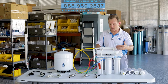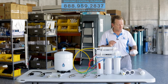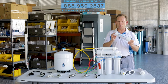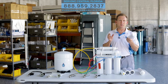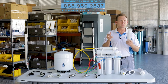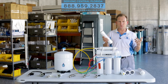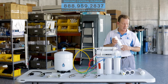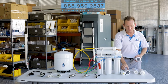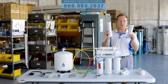In the S5 or S6 systems, you have three pre-filters. The first stage is a 5 micron. This will take out sediment, larger particles — and as we had mentioned in the other video, you're looking at 5 micron for filtration. You take a human hair, it's about 100 microns wide, so that's pretty tiny. So it goes through that, takes out the big particles, then it goes through two exact same filters — these are carbon block filters.